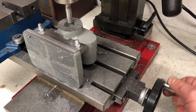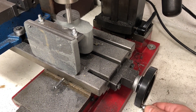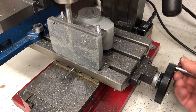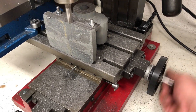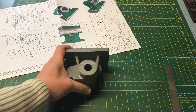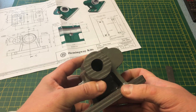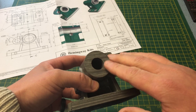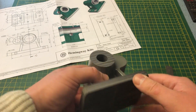My little milling machine is not in tram, and never has been — not from the factory. So this small step over, combined with a relatively small diameter cutter, minimises the rippling effect that this adjustment error causes. If I had used a fly cutter or a face mill here, I would end up with a really clean but measurably curved surface. I could tram this mill, but there is no built-in adjustment, so you are left with the prospect of adding shims between the column and the base, and honestly, adding anything at all reduces the rigidity in what is an already really flimsy machine.